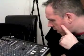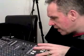Right, so this is a 12-channel analog mixing desk, and it's unpowered. There are essentially two types of analog desk. There's a powered one and an unpowered one, and the difference is that the powered one has the amplifier to drive the speakers built into the desk, so it's all one unit. With an unpowered desk such as this, you have two options to get your sound out to the speakers. One is to have a separate amp, and the other one, increasingly more popular nowadays with better technology and lighter, more compact built-in amplifiers, is the powered speaker route, which is the route I'm going to go down once I get a bit more cash together.